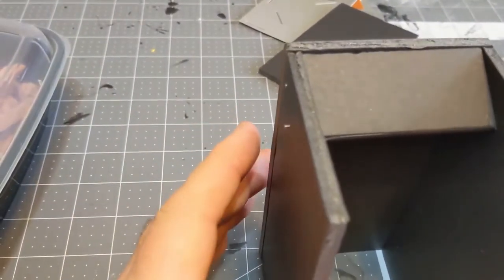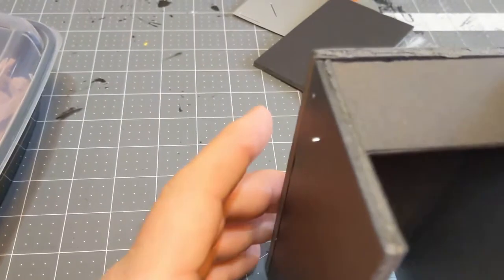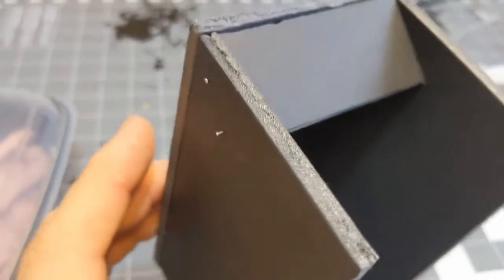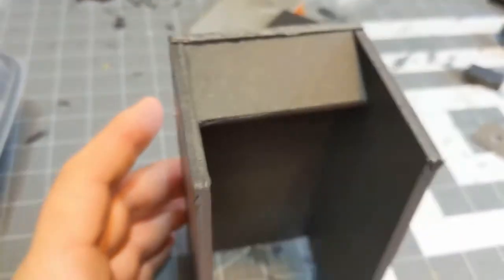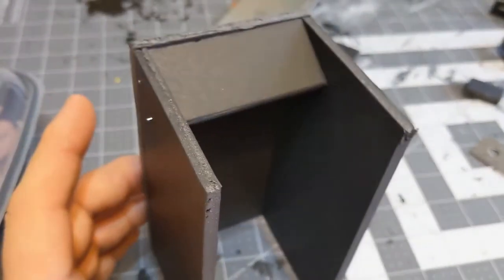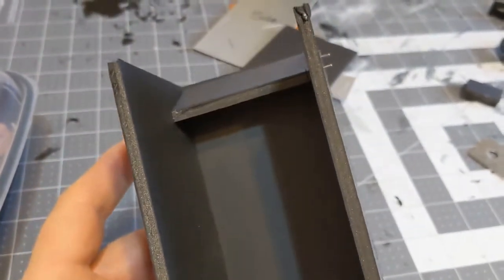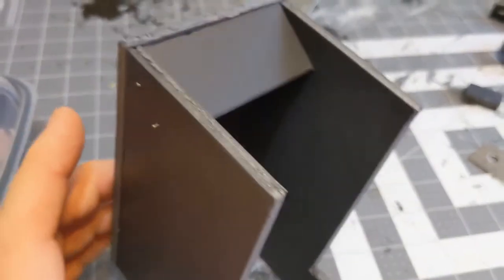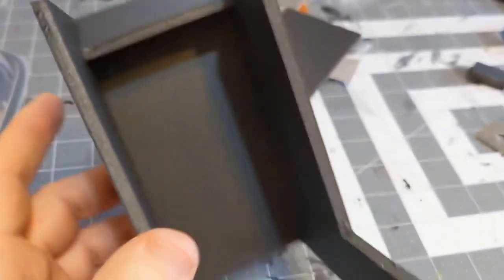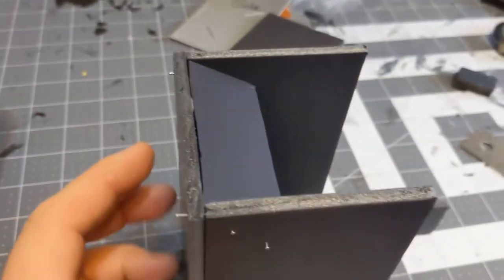I might entitle this video How to Pin Things. Wow. Just dry pinning, no glue. It gives you a great sense of, okay, this is going together the way I want it to. Really easy to take apart, reassemble, hasn't done any damage. And when you do end up gluing it, leaving those pins in just gives you some structural support. So I love that idea.